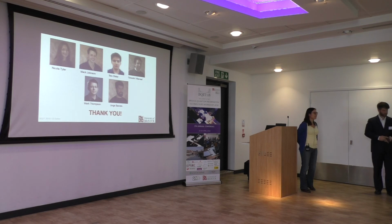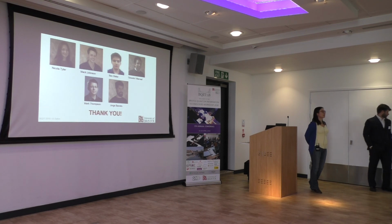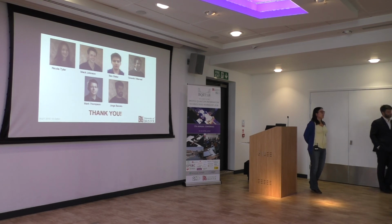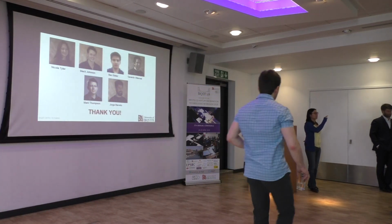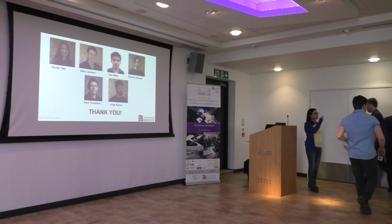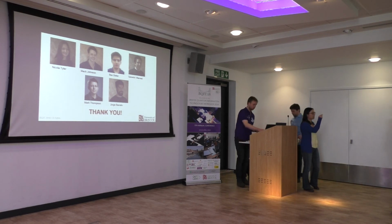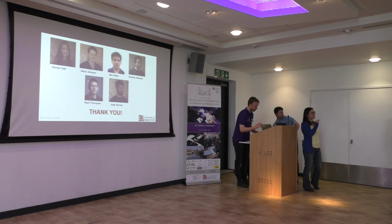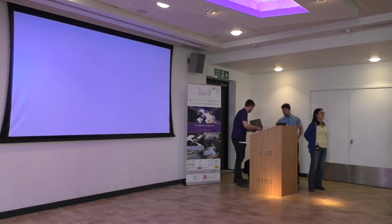You had a slide on the jitter due to the ring detector. Right. And there was a negative linear correlation, but then there was a step change at the end. That's just because we skip some points in between. We look at discrete points. If you could calculate every possible point in between, you wouldn't see that discrete change. Right, so there's nothing physical about the fact that there's... No, there shouldn't be.